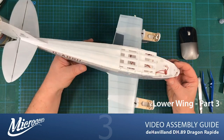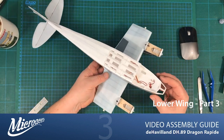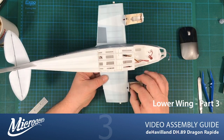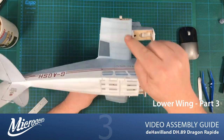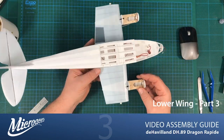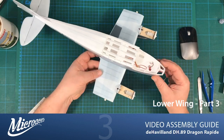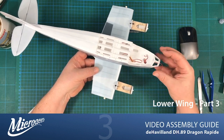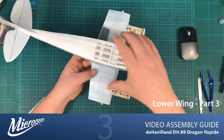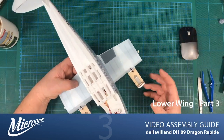So we have reached the stage that I wanted to with showing you how to assemble this particular aircraft. We've got our cables routed, our positions correct for motor plugs and the aileron servo plugs as well. And the nacelles are firmly attached. So the next stage is we're actually going to create the canopy, or the hatch, I should say, and also the nose piece for the fuselage itself. I'm refraining from putting the wings on until we've got the whole of the fuselage created, because once we've got the wings on, the whole aircraft becomes a lot more cumbersome to handle and prone to damage.